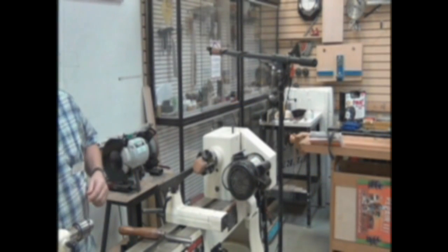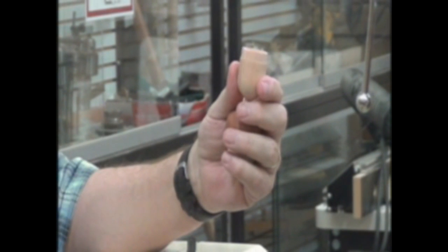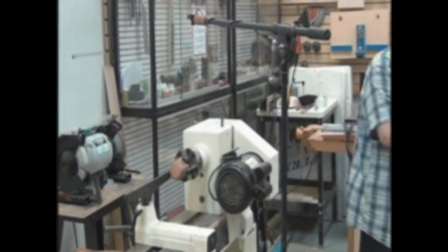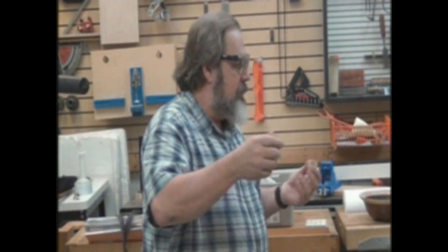The first project is acorn boxes — pretty simple. As one guy said in a YouTube video, they're still big enough for diamonds. A couple of things you'll notice: the tenon has to be pretty long. These were tighter than heck last week because you're only suspending it from here and you don't want the bottom to loosen and lose the diamonds.